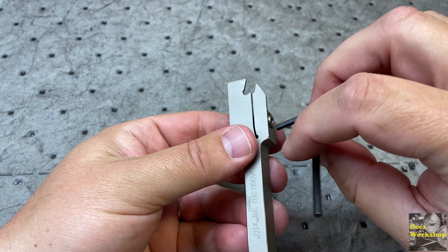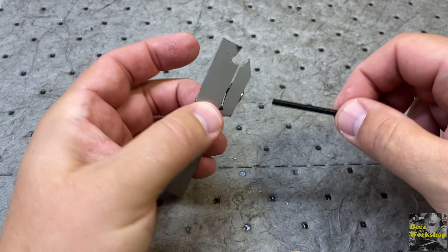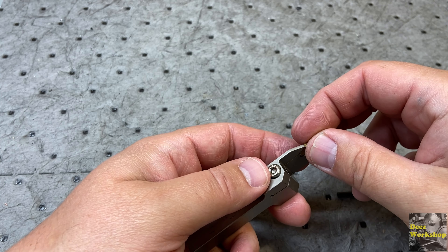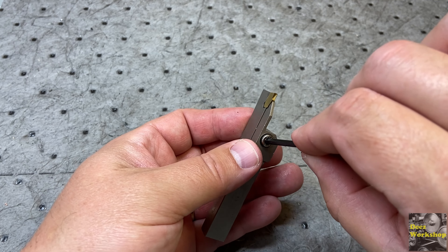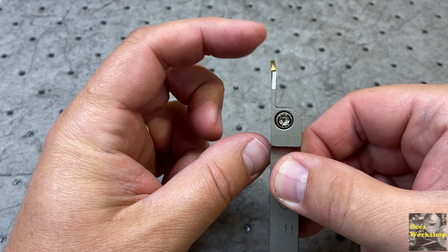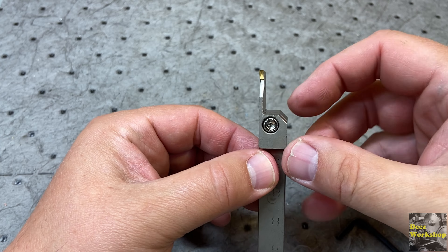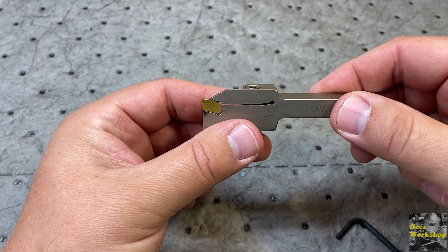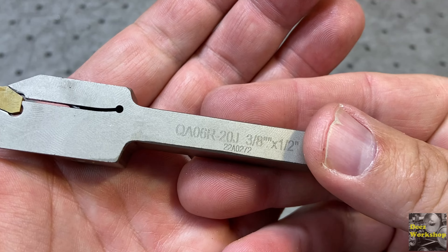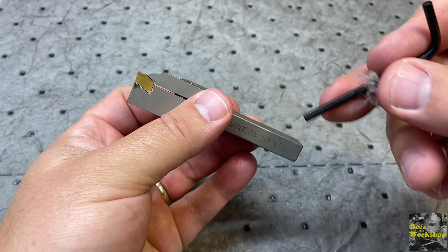You just loosen this thing up — if I was to cut these flanges off, you could slip something in here and tighten it down. Normally, if it wasn't broken, you would take an insert like this, set it in here, and tighten it down. If it wasn't off center, this would be straight, in there nice and tight. And this thing is sharp and it worked great. I was so frustrated when I hit that. But I'm gonna buy another one because I like this — it was a really nice parting tool and I messed it up. Sometimes we make mistakes and have to replace our tooling. If you're interested, search for this stuff on Amazon — that's where I got it.